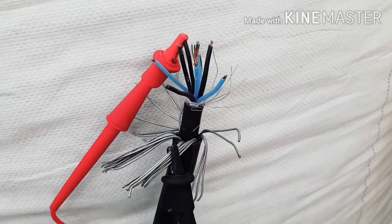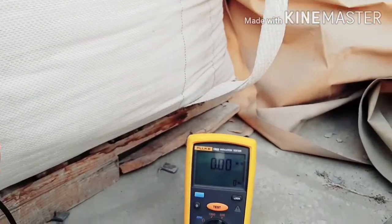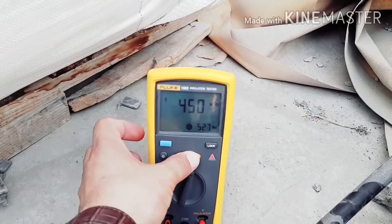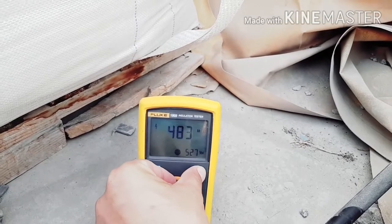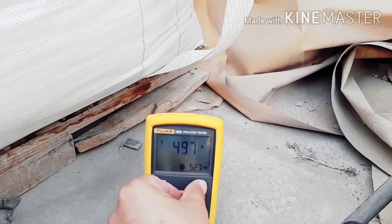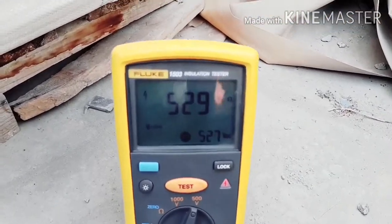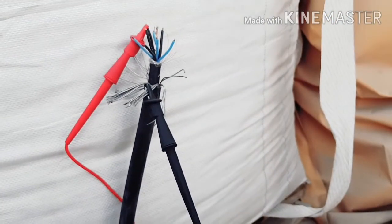The neutral is connected to common and I change the cable conductor. Now I am performing the testing. I push the button and you can see: 447, 45, 60 — it's showing readings and voltage supply is 527, so it means 500 but 27 is a little more. The insulation testing is good and the cable insulation is good because minimum range is 50 or 43 mega ohm.